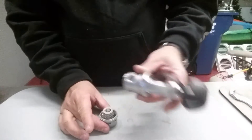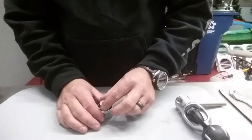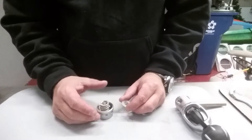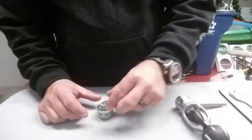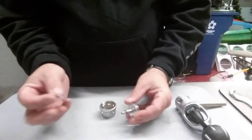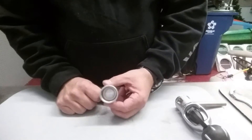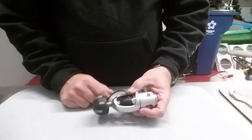I'm going to turn the regulator standing upright so all the components pour down into the tail cap, and set the first stage aside temporarily for a quick inspection of the parts. I've got a washer, a spring that goes over the top of the piston, the piston itself, and on this particular one there's another washer on top — and that's basically the tail cap piece itself.